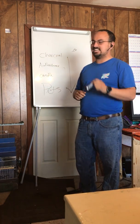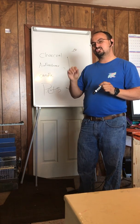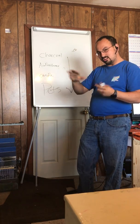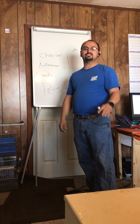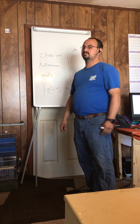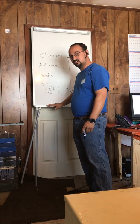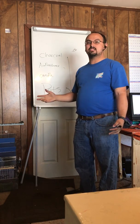Cat hair is a particularly pesky hair. Super fine dander. They make a super fine little hair. You know that. That's why they call them Fluffy. That's another cat named Fluffy, right? That stuff floats, and it will clog up a filter in a heartbeat. So if you have a unit where your vents are low on the floor, you may need to change your filters more frequently. Don't be surprised.